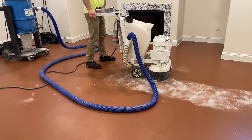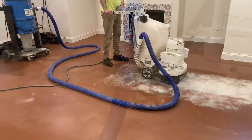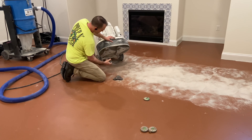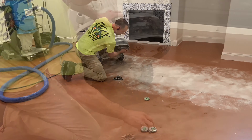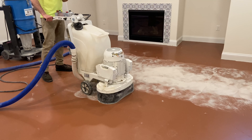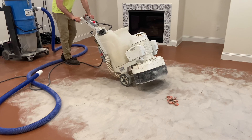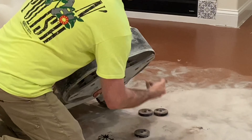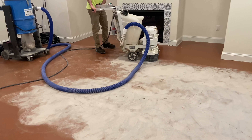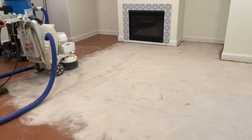After a few passes, Josh adds weights in an effort to increase production. Not satisfied, Josh switches to a 16 grit, 10 segment diamond. While these diamonds certainly increase production, Josh is convinced there's a better solution and switches to a 25-30 two segment diamond. These diamonds prove to be the winner, and Josh glides through the surface maximizing its time and diamond use.